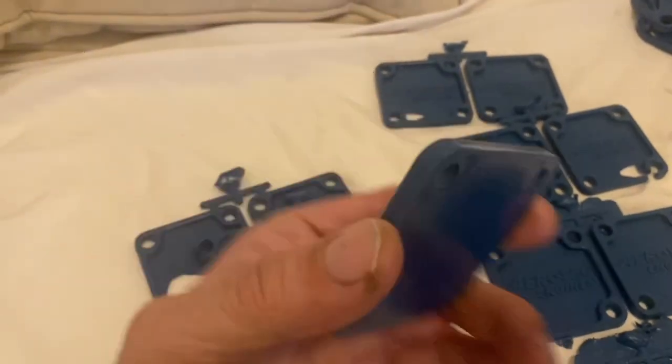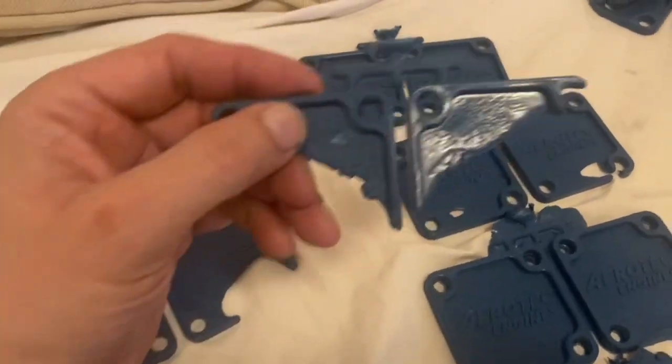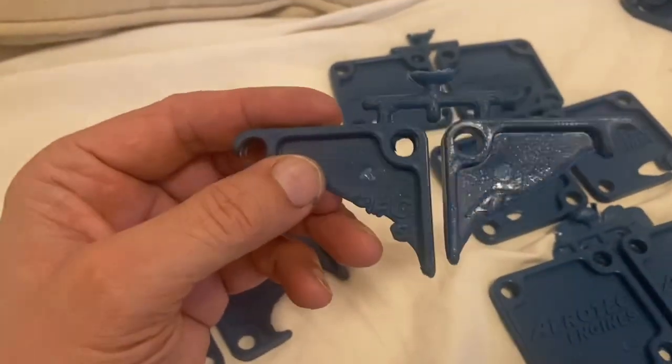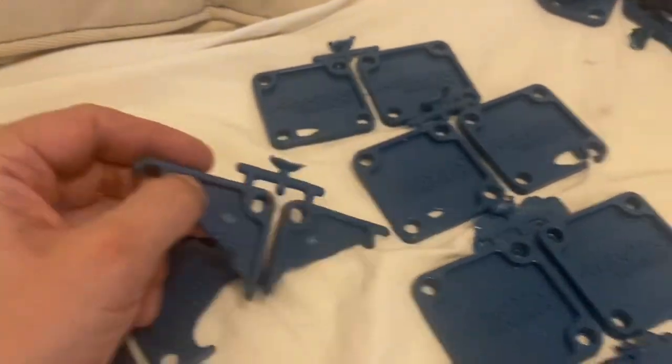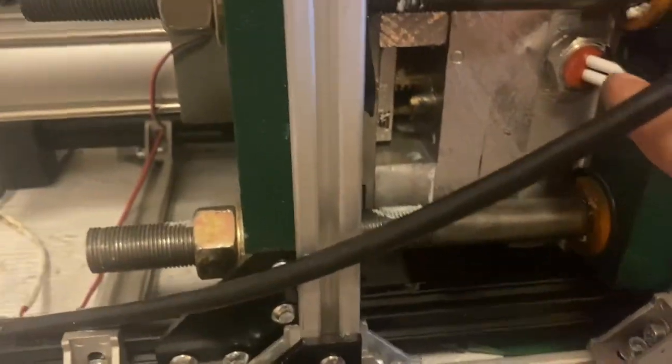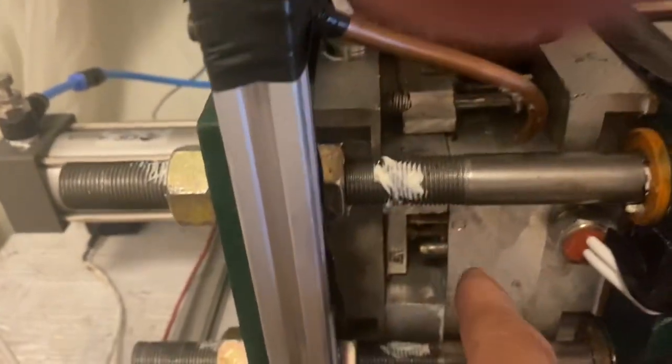Here's a good part — you can see it's filled quite nicely. I only run a minimum temperature in my mold of 60 degrees centigrade. I have two mold heaters: one right there and one right there. The heat transfers into the mold right there, and I have a heat probe that monitors that on the corner of the mold.